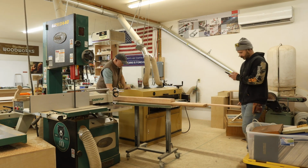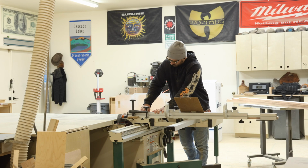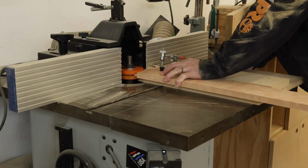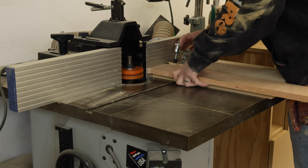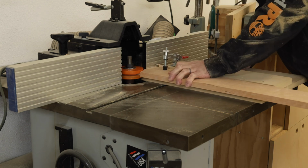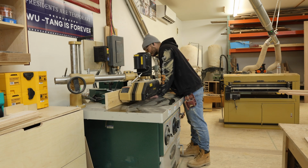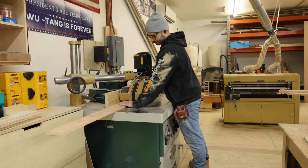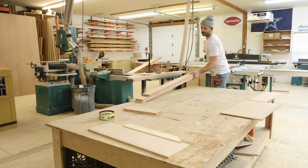And I ran everything through the sander now because I'm not going to be able to run it through the sander after I glue this thing up because it is pretty big, this panel. Go through our standard procedure here, just coping. We got one center stile and then a top and bottom rail, getting those coped, and then run the groove on the other shaper. All right, and then those parts were ready.